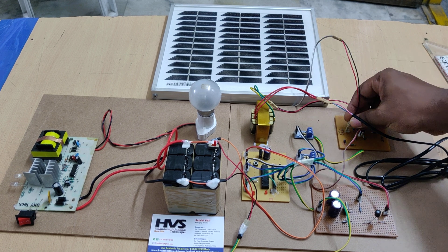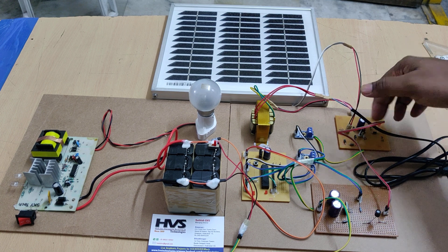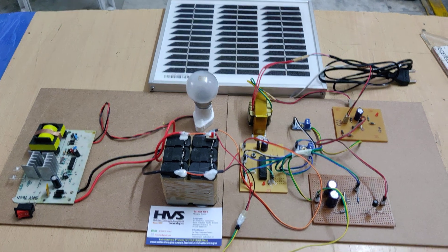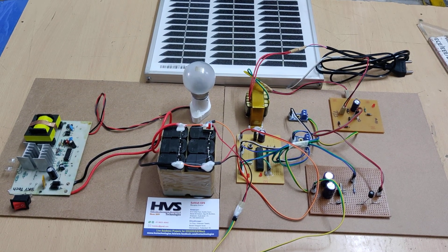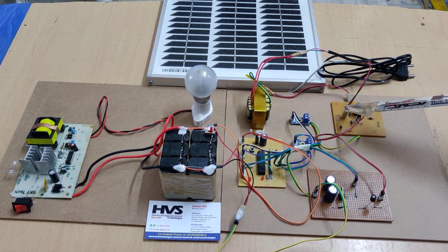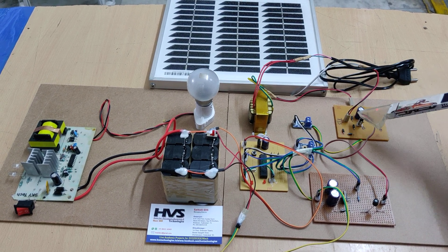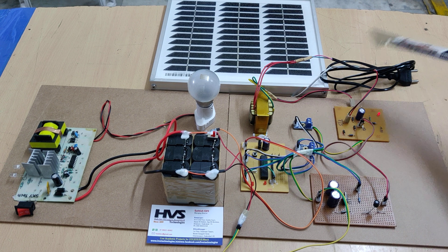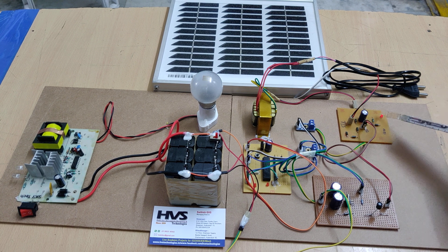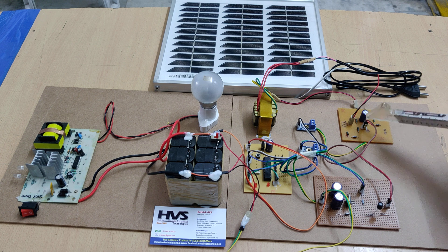For the full project, we connect the solar panel at the TRS slots and the battery at the B slots. This is the charging circuit — it provides 12 volts DC output. We use rectification and filtration. When providing DC input from the solar panel, these four diodes act as a polarity corrector: if the solar panel is connected in reverse, the four diodes will rectify that to plus-to-plus and minus-to-minus.